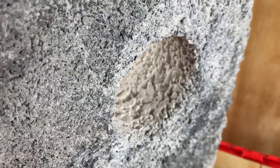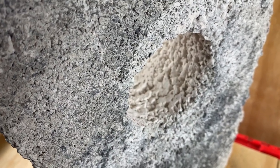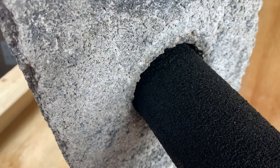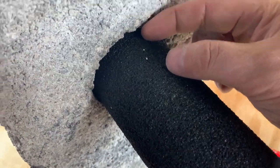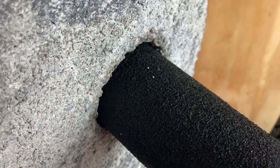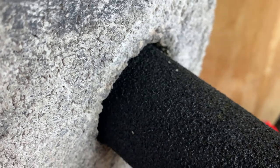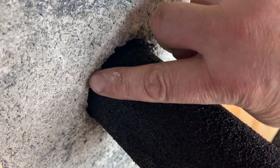Once we have cored the hole, we clean all inside and dampen it down to make sure that the seal and bond adheres to the fabric of the wall. We'll clear inside with a damp sponge or cloth. Once we've done that, the insulation sits inside — pull the insulation out, then bond and seal all the way around to give a cap or seal inside the fabric of the building, then push it back in and seal around to make the perfect seal.